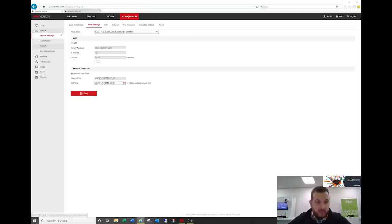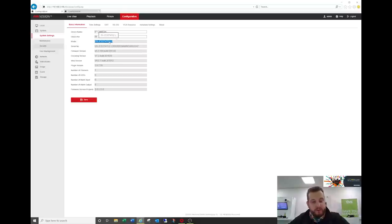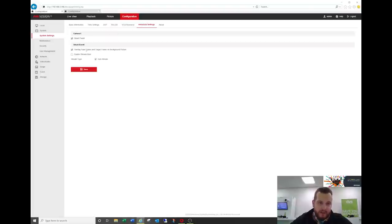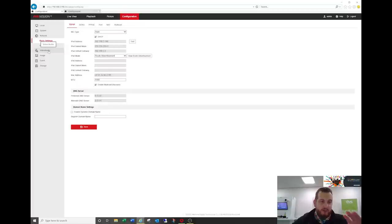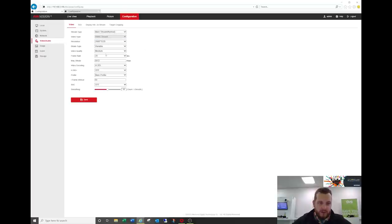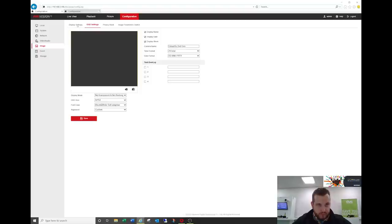We're now in the office with both cameras fitted. This is the second generation Color View G2. I have a test firmware which allows the white light to be on solid, flash, or brighten on an event — I'll show that as a teaser toward the end. Under the camera settings, VCA resource is set to smart event, face capture, or monitoring metadata — we're sending metadata on smart event and overlaying rule frame and target frame on the background image. Under video and audio, we've set it to 4 megapixel, 20 frames per second, H.265 standard — not H.265+.